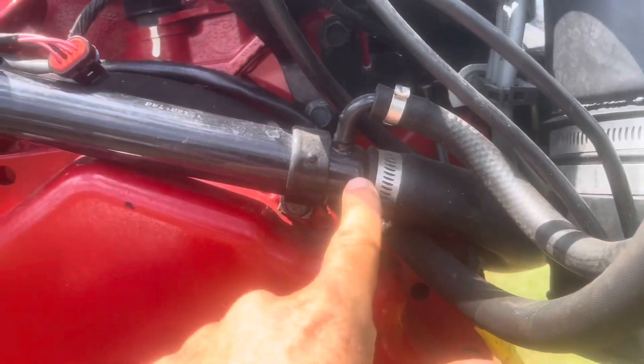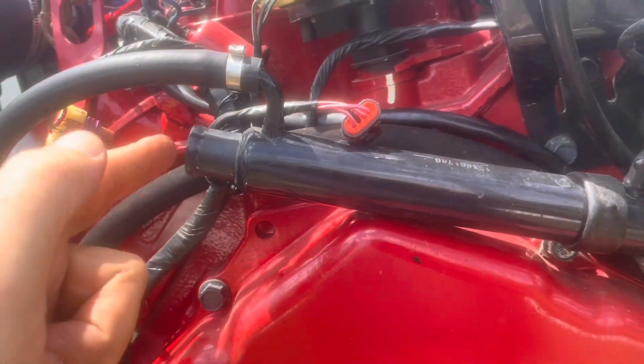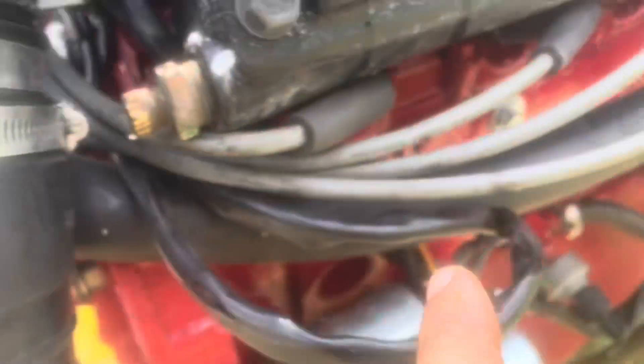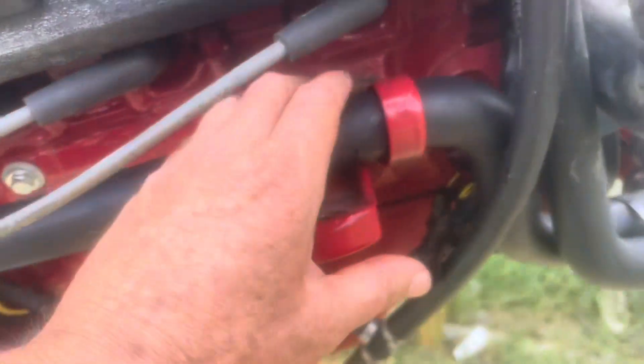On most boats, your water inlet's over here — the water inlet comes and attaches here, flows through here and goes over to your engine from there. This was backwards: your water inlet was here, flowing down here, and the pump comes down and flows into your pump on the front of the motor. Again, another clamp for the water right here, clamped to the front right motor mount on this side.